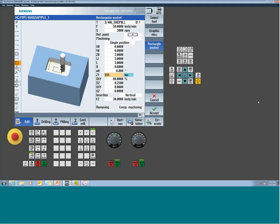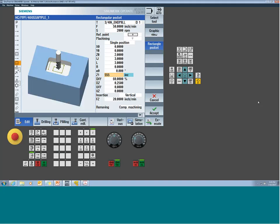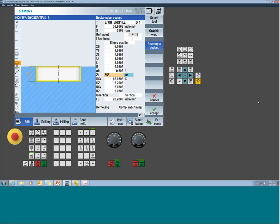On CTX machine, the TRACYL mode takes diameter. Does it always need the diameter on all machines? Yes, because that is the value that we're wrapping about, right? So we have to know what we're wrapping, what surface. So we have to know that diametric value. And I don't know of any way of toggling that to a radial number, but it's always a diametric value.